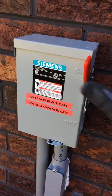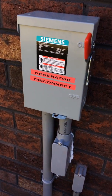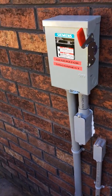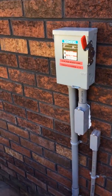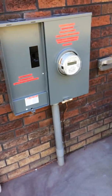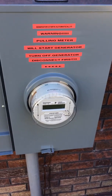To get past that, the inspector asked me to put in a simple throw switch — 60-amp — because the generator is a 50-amp generator, and 115% of that is 57 amps, so the 60-amp disconnect is fine. I just labeled the generator disconnect so they can see it easily.